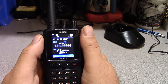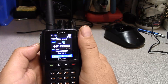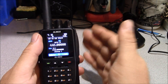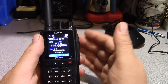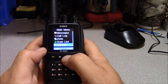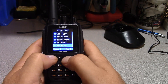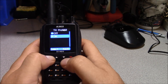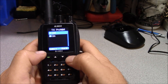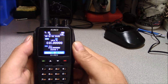Here's another quirk about the radio. You get it out of the box, you're excited, charge your battery, put your amateur frequencies in, go to push-to-talk, and you get transmit prohibit. The radio as a default has transmit prohibit on both VFO modes. The way you address that is — since your VFO modes are considered channels in the radio — you go to your channel settings menu, select it, go to transmit prohibit, select it, turn that off, go back, exit, and now you can transmit.